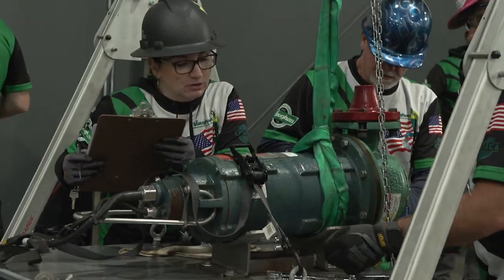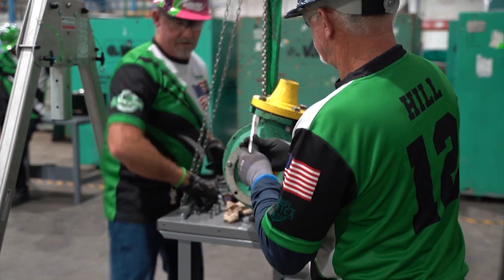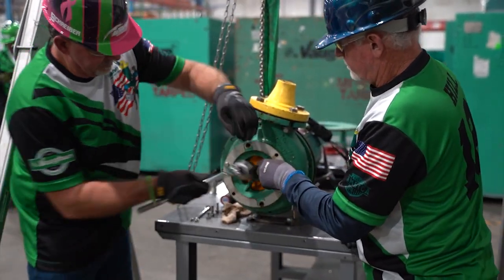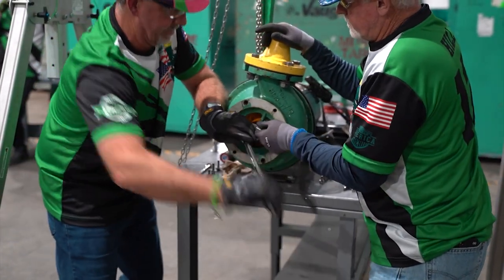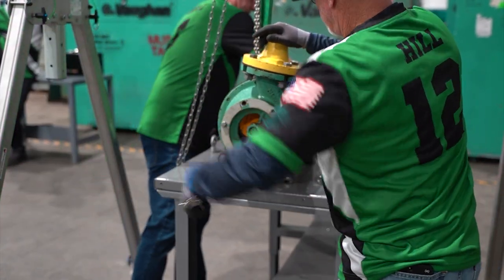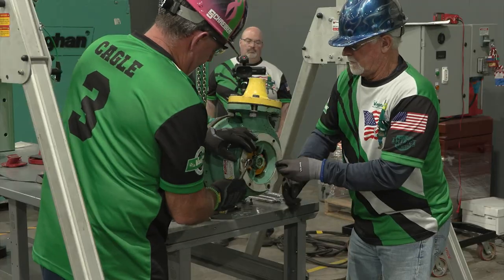Using the provided aluminum bar, place it between the impeller and cutter bar fingers to loosen the cutter nut using the half-inch drive breaker bar and the 1-11/16 inch socket. This must be done prior to removing the suction plate. Any member that touches the cutter bar or impeller must wear leather gloves.